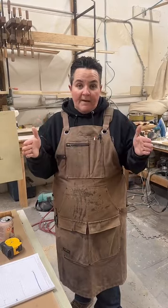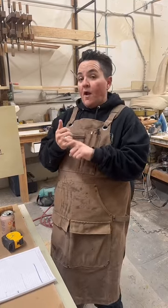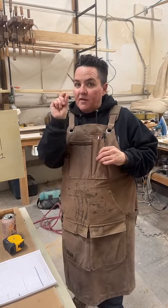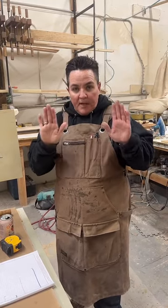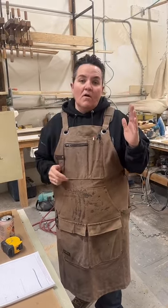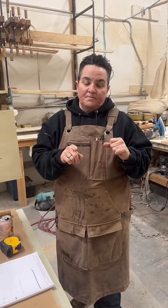left after the run of cabinets is there, which can allow for scribe molding or to be scribed into the wall. If you don't know what scribe is, it's a very small, thin piece of trim that usually is applied to the front of the cabinet and extended out to the wall so it has a really finished built-in look. There are cabinet makers and some styles of cabinetry where they won't add the molding. They'll actually make the cabinet faces just a little bit bigger than the hole size so that it can be trimmed exactly to fit that wall. And that's called scribing it.